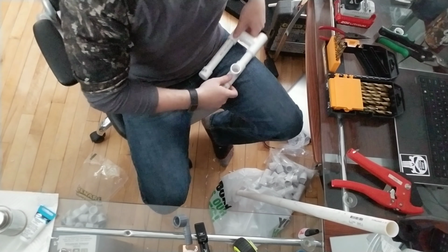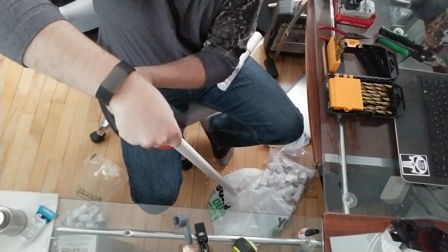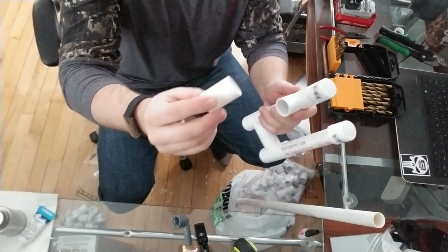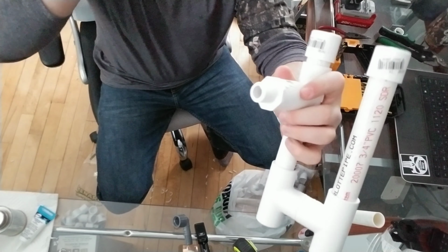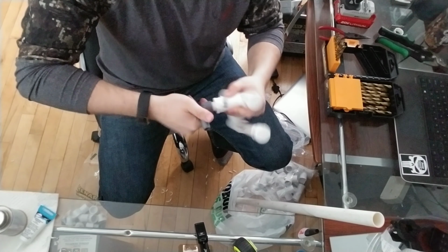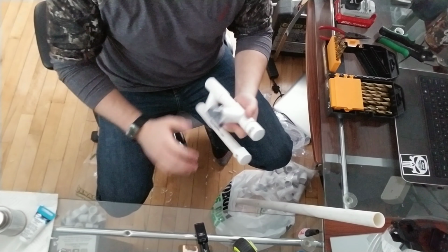Once we're there, we're gonna use another inch and a quarter-ish piece, because we gotta make another connector. Like I said, I use about 2 fingernails, because once you start trying to just speed along and get things done super quick, you come up with weird methods, you know what I mean? All right, so now that new inch and a quarter piece slipping in there, our slip to thread, our barbed threaded 90 degree, screw this on here. Boom, spin that straight down.